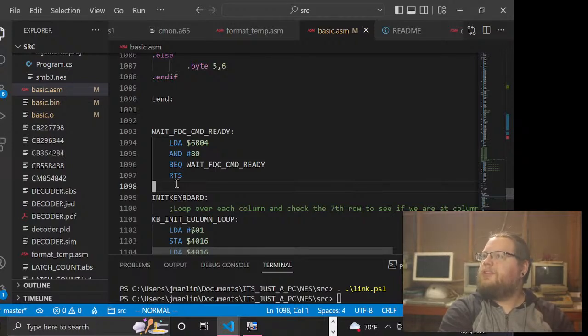the channel I mentioned last time used a trick to pass, e.g., a string to the subroutine. He put an ASCII Z right after the jump to print instruction. Yeah, so kind of like exactly what ProDOS does, I think, where it just puts it after, reads the return address, uses that, and then jumps to after the end of the payload. Yeah.